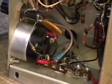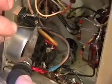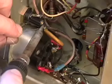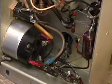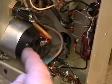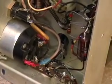But that was the resistor for the neon bulb, and it's going to be removed. What you're going to do is just the first position is where it is at. You're going to unsolder it there, and you're going to unsolder it from its other location. The other location may not exactly be on the fuse holder. In some cases, I've seen it where it was hanging in midair off of one of the positions on the input connector.